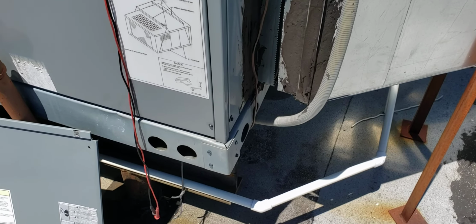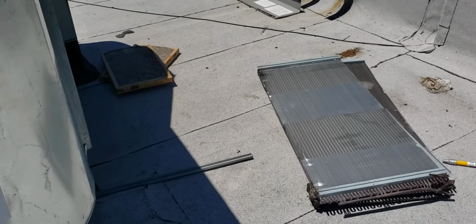Now, not to mention the amount of money it is going to cost you when the compressor, the valves are ruined because it's pumping liquid, and it's a vapor pump, so you're going to ruin your compressor as a result of that. All right, so maintenance is important.